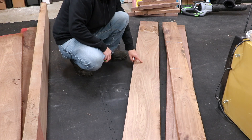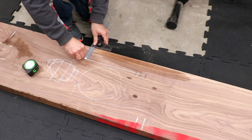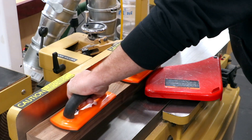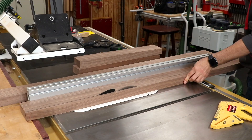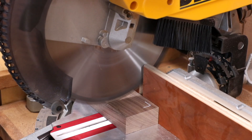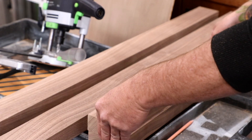Now for the base rails. I'm trying my best to pick grain that follows the specific curve we're going to cut into the rails. I found one great section for the front rail — it's really the most important, but the rest are just okay. I really don't want to get another eight-quarter board so we'll make do. The parts are rough cut with the jigsaw and bandsaw, then jointed and planed to final dimension. The long rails are cut to length at the chop saw. The short rails are also cut to length — but spoiler alert, they're being cut to the wrong length. I'm not going to say it's Jason's fault, but I should be double-checking everything the new guy does. Stay tuned for more on that.